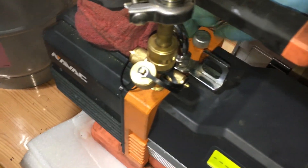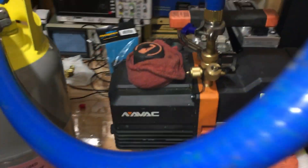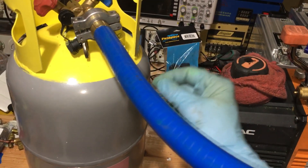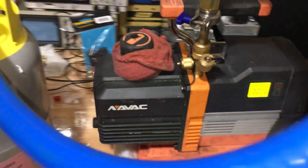You're supposed to have the ballast on — I don't even have the ballast open — but it's not really that important because my oil is clean inside there. I don't have to worry about getting any moisture out of there. This cylinder doesn't have any moisture; it just has minimal moisture from when it was manufactured, and then they purge it with nitrogen and fill it back up with nitrogen.